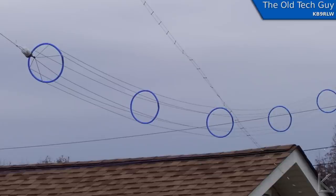You can get the same effect by using multiple wires and spreading them out, so they're all tied together electrically. Here's a homebrew caged dipole image — a lot of people will take multiple wires with little separators to hold them apart. You end up with a lighter antenna; it's still heavier than a regular dipole but you get that larger diameter effect and broader bandwidth without the weight. They're still a bit unwieldy for HF though.